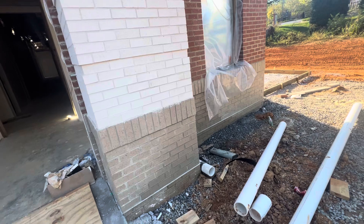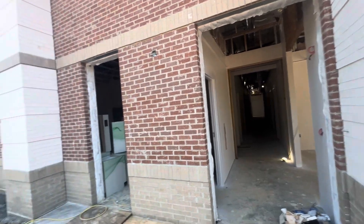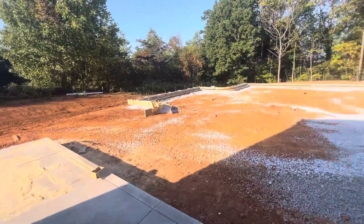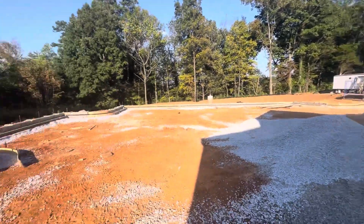That's like through-wall flashing. You can see plastic because they started to paint inside — prime and first finish coat. Here you can see curb and gutter for concrete, for the parking lot — curb and gutter for parking lots.